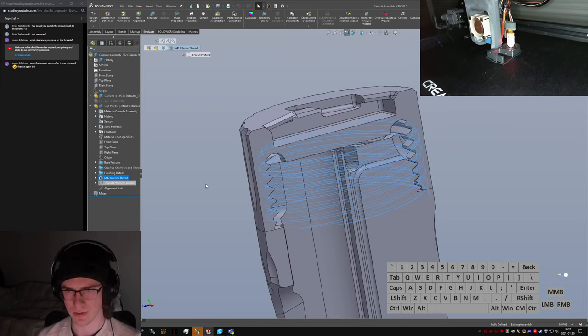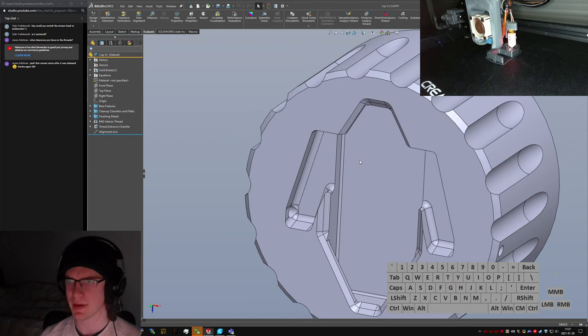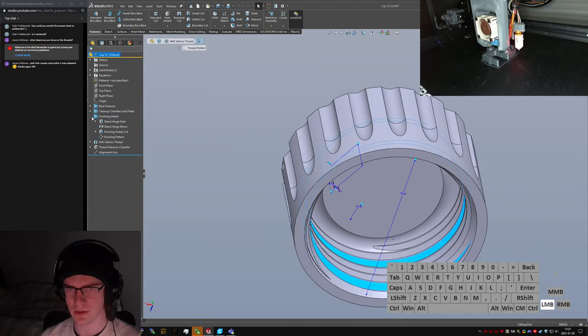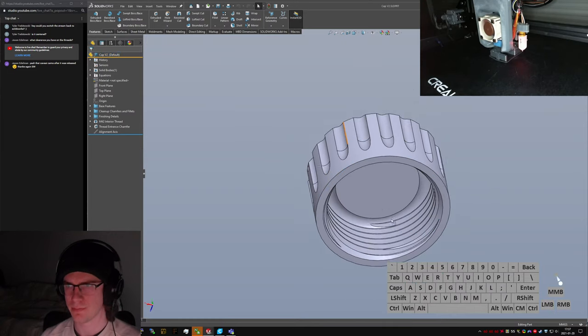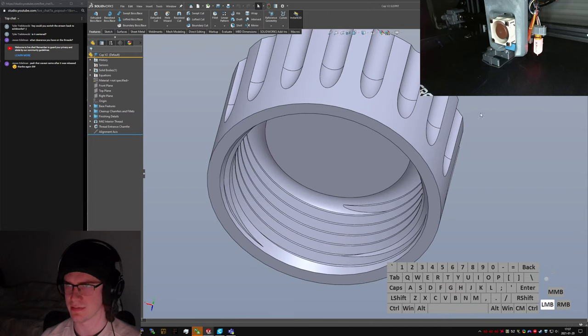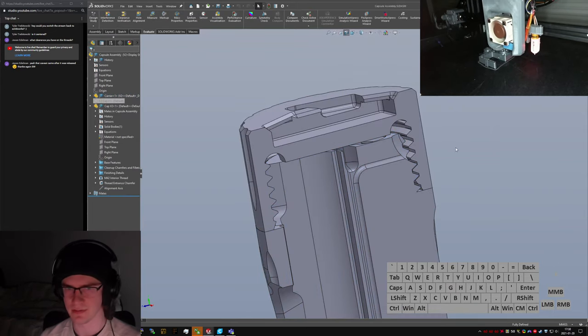And two interior thread. Wow, I guess maybe I did only do... I'd be surprised. Maybe I was only running with 0.1 on those. If that's the case, then I will only do 0.1 on the exterior thread, because a closer fitting thread is always a good idea.